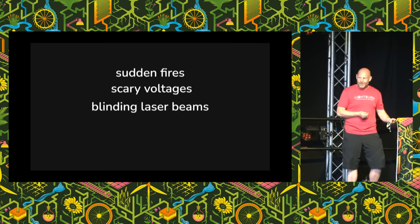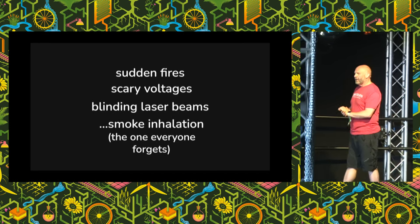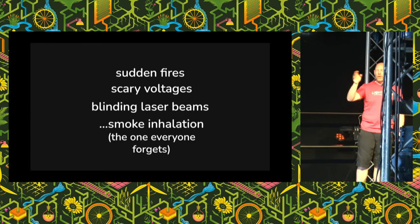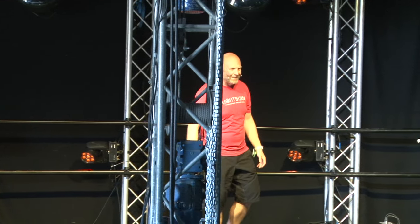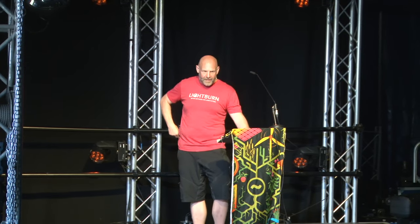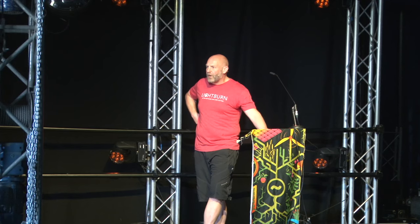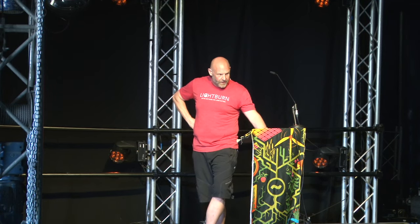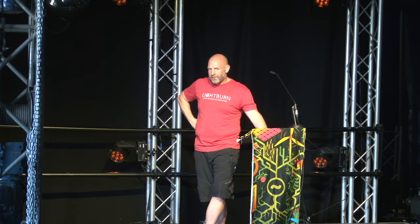But I am going to address some of these concerns, don't worry. And the one that I think people often forget is you're creating a lot of smoke. Something that people say to me constantly when I'm laser cutting is, oh, I love the smell. And then they're huffing the smell in. I'm like, you don't really want to breathe that in. Safely extracting your fumes to the outside or filtering those is as important a consideration as the risk of fire or the scary voltages or the blinding laser beams.